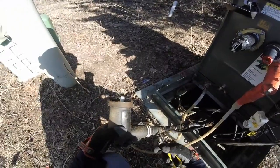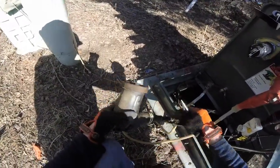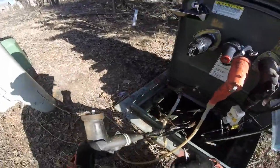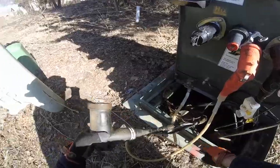Once that's in place, here's the old elbow. You can see the issue with this transformer was there was some oil leakage in that elbow, and some of the rubber there is very distended or swelled. So they're going to take that apart and put a new one in.